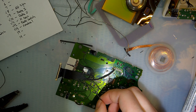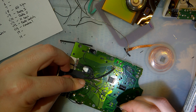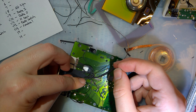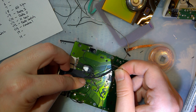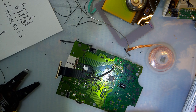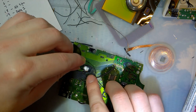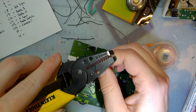Right, next is data latch. So what is that? That should be H10. Where is that? That is also pin 18. Uh-oh. Did I mess that up too? I think I did. No, this one is pin 18. That's correct. But I think the one where I have two soldered to pin 13 is incorrect. One of those should probably be on pin 14. Whatever pin 13 was.